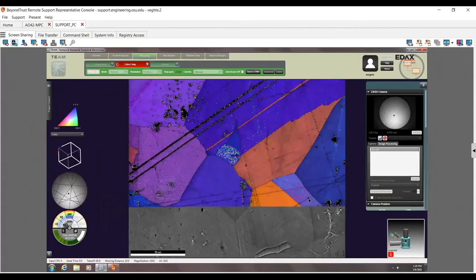If I see something like this, I would usually increase the number of bands I'm using. I don't know if this is defaulted to 6 or 7 bands right now, but you can see it's a speckle between two colors. That usually tells me there's a pseudosymmetry problem, and because of that I'm getting, not quite a coin flip, but it is choosing between two solutions. That is interesting. A very fine scale twin here, which is kind of neat.